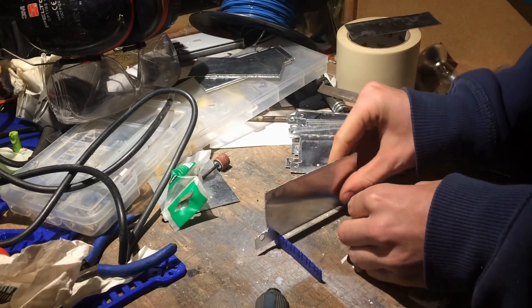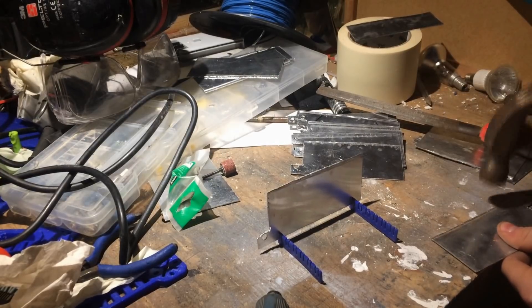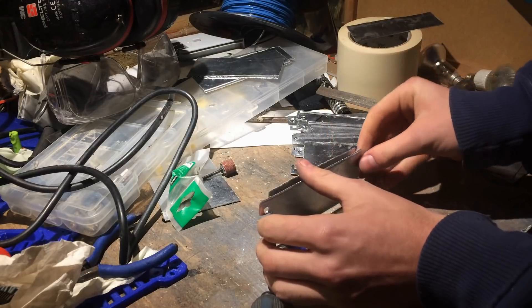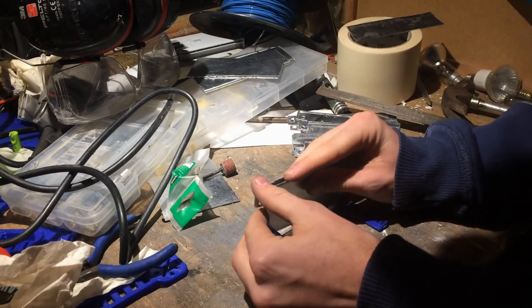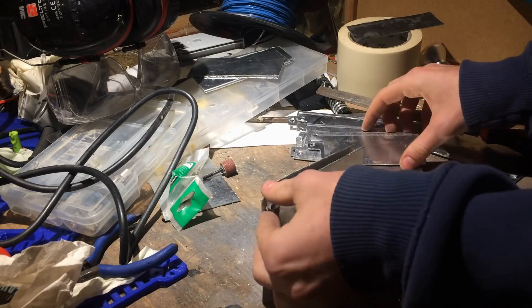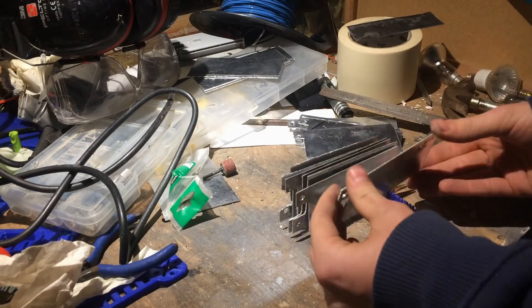The way these plates and cells will be laid out is that there are 6 cells and the supply will be 12 volts, so each cell will get approximately 2 volts each, which is about right for hydrogen generation. You can see how the tabs in each cell work — one cell has a positive and negative terminal, and on each cell the positive terminal connects to the negative terminal of the next cell. So we have 2 tabs that are next to each other so we can easily bolt through. This is a series circuit, and is why the 12 volts gets split down into 2 volts because we've got 6 cells.